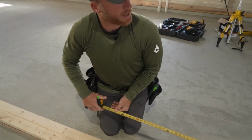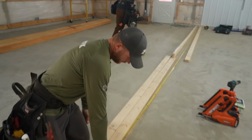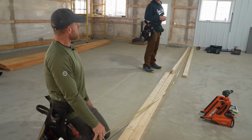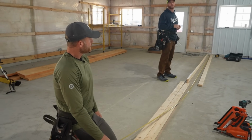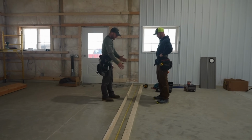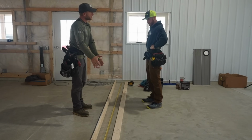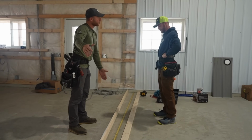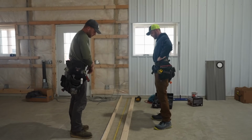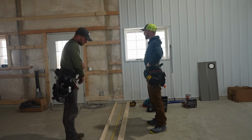Then let's get a total dimension. So let's just use 24 feet as a guide. I say we go, yeah, the problem I have is when you go 8 foot center, you have 2 foot of window here, 2 foot of window here. And if you go another 8 feet from the center, now you have two more feet of window. Edge, 8 foot. So it'll be centered at 6 foot. Because you're gonna do 4 foot windows, right?